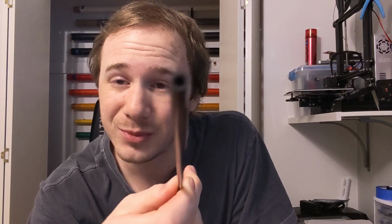Now, I use two-piece lower spreaders all the time when building outdoor kites, right? You take an inner ferrule, you ferrule one of the lower spreaders, you put it through a little cross-fitting like this guy, and then put the other spreader on the other end. Simple enough. The problem is, for this indoor kite, I'm using some pretty small rods. I'm using this 4mm diameter pultruded carbon. Now, the interior of that's pretty small, so I'm concerned about the strength of that approach, in that an internal ferrule wouldn't be very strong. So I think that idea is out.